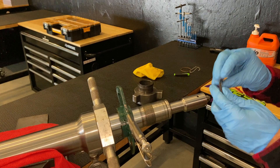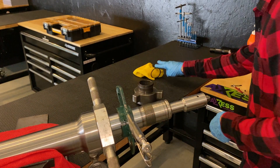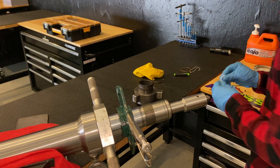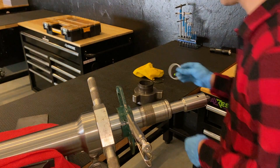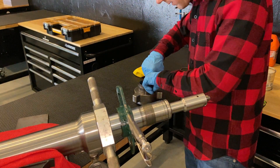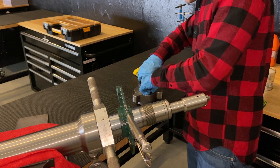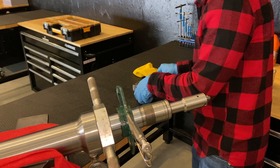Load the new o-ring up with plenty of grease and put it to one side. Put the backup ring and do the same on that. The backup ring has a split in it — this just helps ease the installation. I'll pop that in first, and once that's in place I'll go from the other side and put the o-ring in.